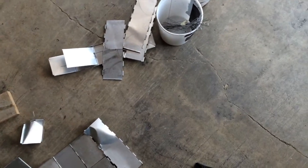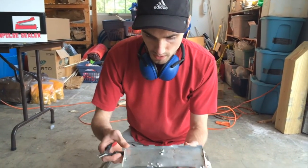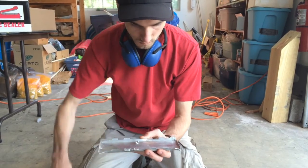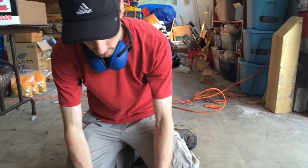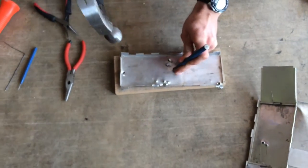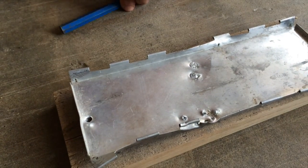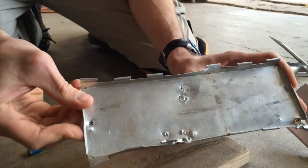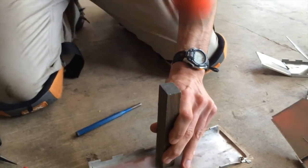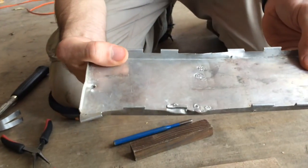The first thing I'm going to talk about is how to repair tooth damage in a trap. This is an exceptionally bad one where a bear actually punctured through. The first thing you're going to want to do is bend all the tabs of metal back in — bend these down. We'll put this down on the wood block, use the quarter inch punch and a regular hammer, and just pound all these in. We got most of the big dents out. At this point I'll take the small wood block and the dead blow hammer and finish it off. That'll take care of all these teeth marks.